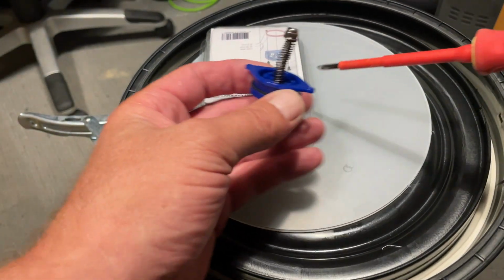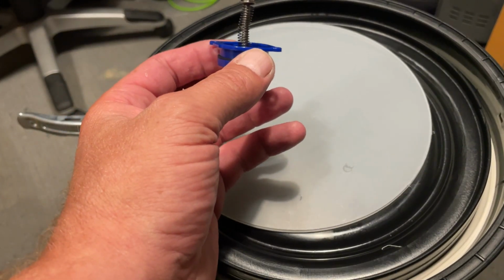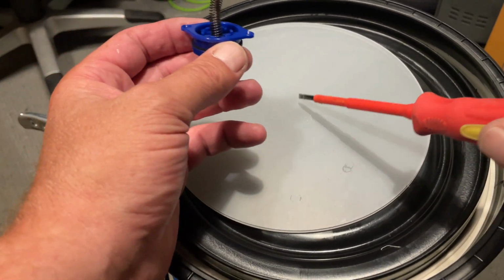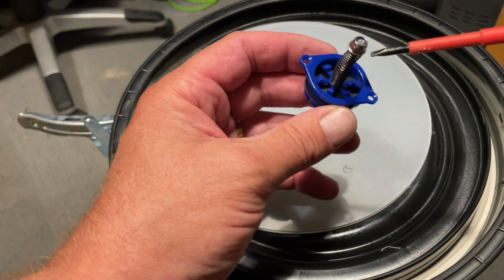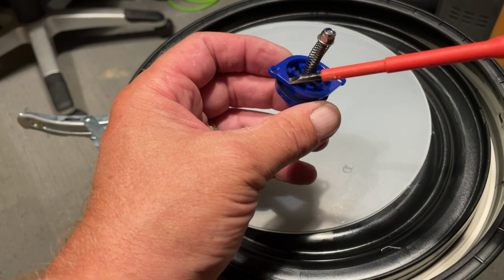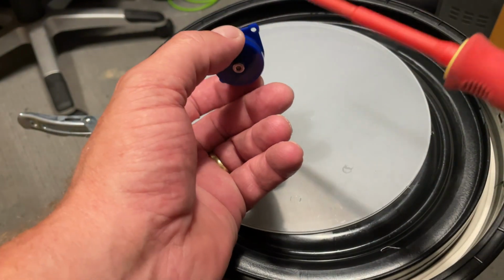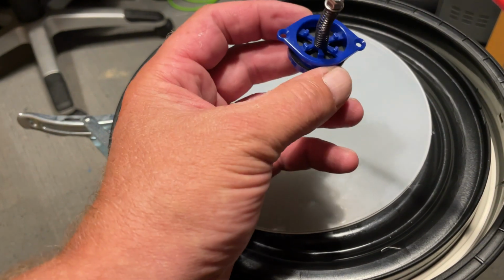When fitting to the Perspex, I determined center, drilled a 20mm hole with a hole saw, as I said, and I applied CT1 to the perimeter of this unit before screwing it in. And remember, pilot drill your holes in Perspex, otherwise you're going to shatter it.